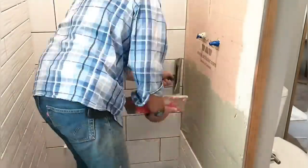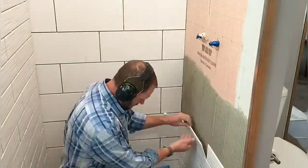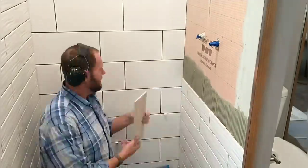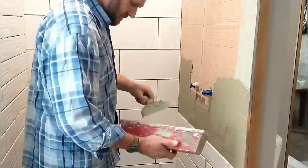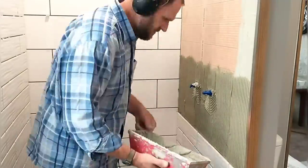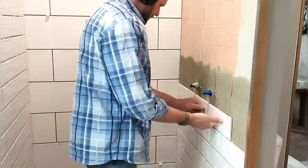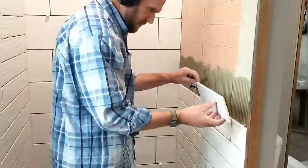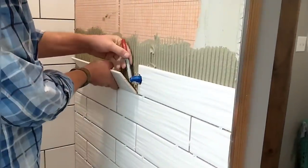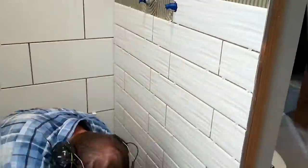I started by meticulously getting that base row level and then just started going up. On the previous wall I was worried it would get out of level going up, especially with so many long thin bricks, but it stayed very level all the way up. I check it occasionally with the level and I've worked my way up almost to the hard part — where I need to make some cutouts for the faucet handles. Luckily one of the faucet handles landed on a seam, so that one was relatively easy; I was able to make some side cuts and build that half-moon contour shape on each piece.